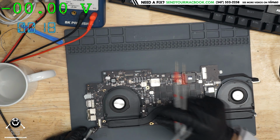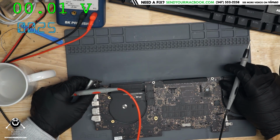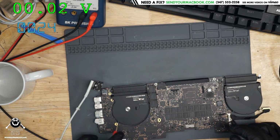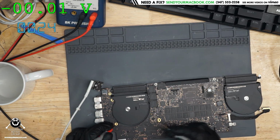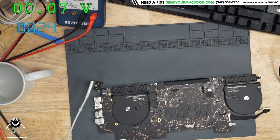Neither of them give a green light. Very interesting. So our issue here may be a lack of green light, more so than a missing PM Sleep S4L. Now the issue is not going to be that the SMC is not turning on, because the SMC has to be turning on for PPBus to be what it is. And I see something funny right around the one-wire circuit.